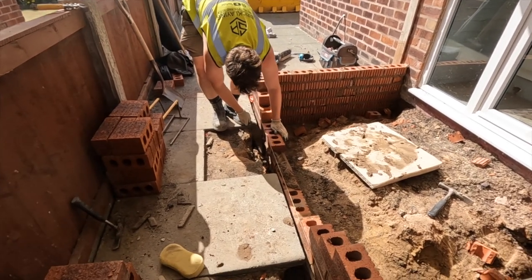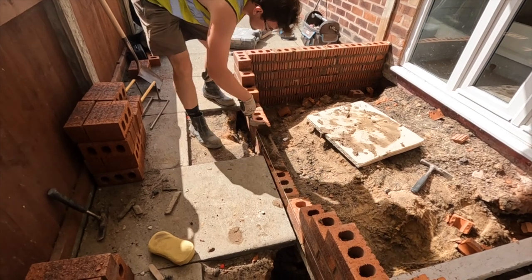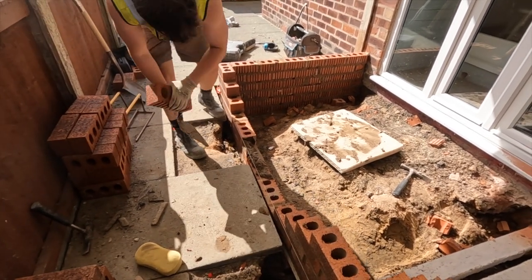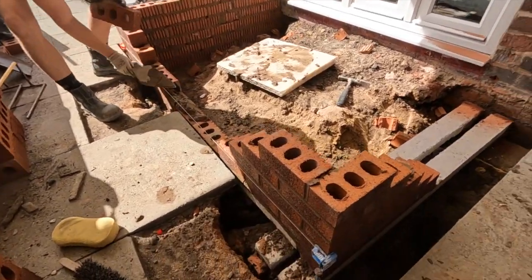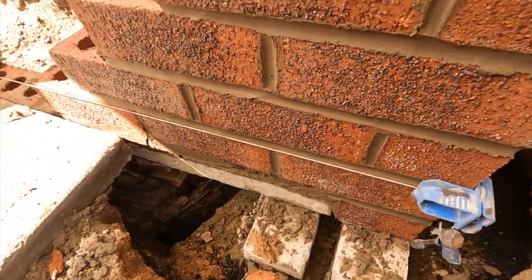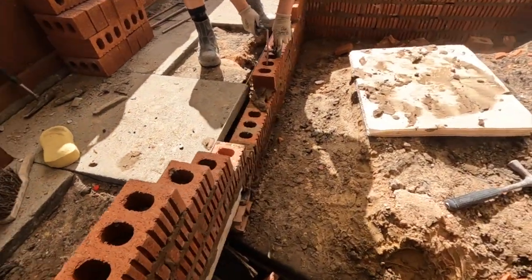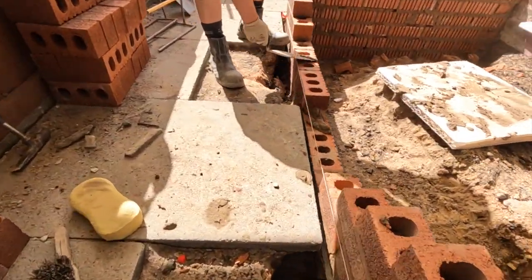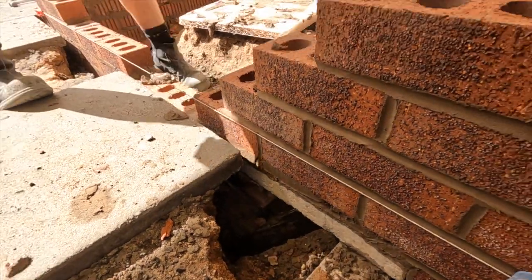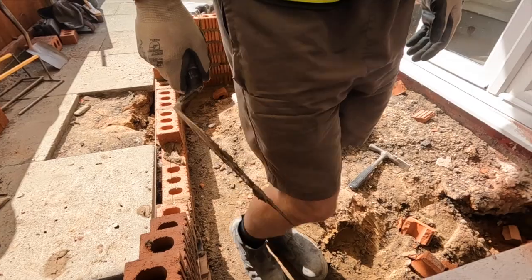Right, 10 to 12. Alex is just running the front in, which has got a decent size 3/4 in it, so just to make sure I get that in the middle and nice and uniform. There's the lintel setup. Got the 2 1500s set well onto that little pad in the corner. And then we've got that onto that lintel and across onto the other side. And then we've got another one to cut up there for the inside skin, which will be done after dinner.